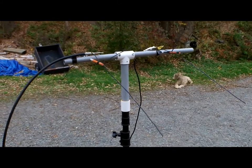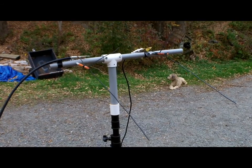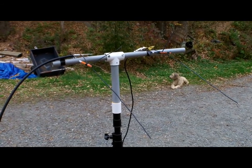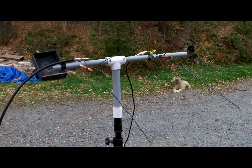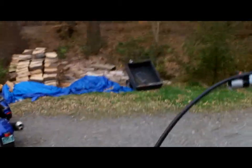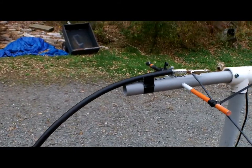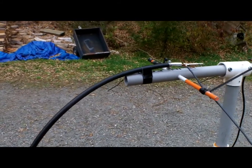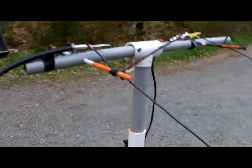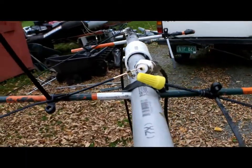So I decided I will do a trial run — design a two meter dipole parasitic array. What I've got going here is basically a series of jumpers. This is the stub length I've settled on. This is 50 ohm LMR 400 coax, I had a scrap of it sitting around. I get the dipole jacked in — this is the driven element right here.